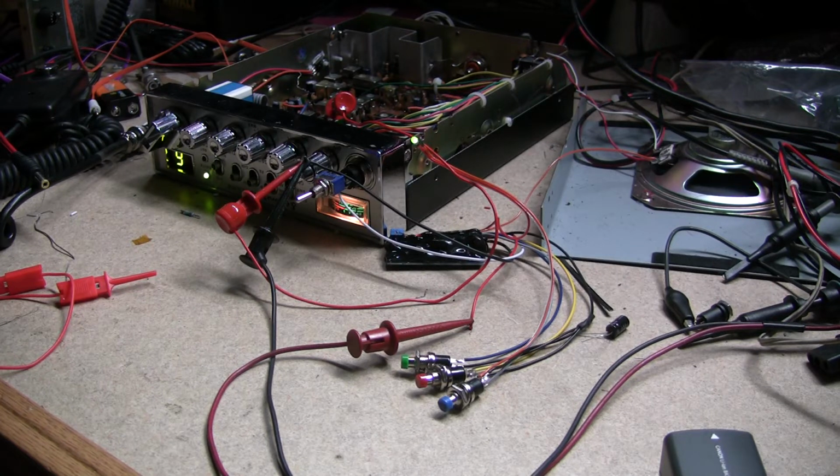So you can get a relay. You wire it to pin 3, so when you key the microphone, that trips it and it'll key it. But you don't need that. Just keep the microphone keyed and hit the green button, and it plays back the whole thing. It'll just go and go and go over and over until you stop it. So, crystal clear audio. It's one of the best boards, with the audio chip that's designed to work in it.